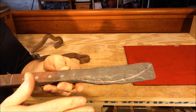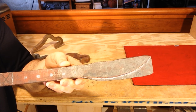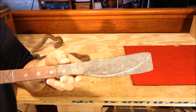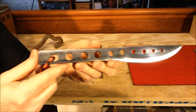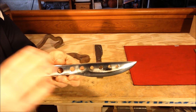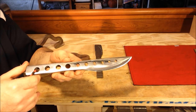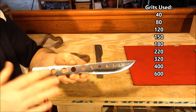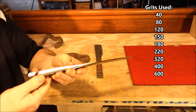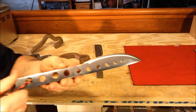Once you've got the holes drilled, you go into heat treating. Spring steel heats up to about 1500 degrees; you quench it in oil and then temper it at about 400 degrees for an hour. After that you have the basis for your blade, and it's just a matter of grinding out all the forge marks and sanding — starting with about 40 grit on the belt sander all the way up to 600 grit — and then of course sharpening it.